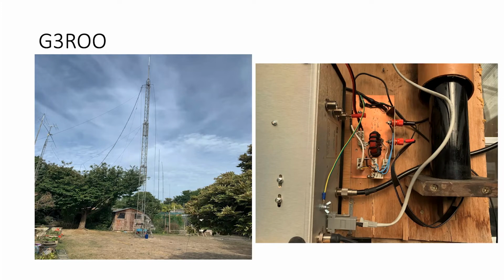There's not a vast difference. It's only 10 to 15 dB, 2 to 3 S points difference, but the difference is there, and it makes all the difference if you're trying to bust the pile up. I can't remember off the top of my head. There are 3 other bands, well, modes I cannot do, but I can always use it on either the Marconi or the doublet mode on all the HF amateur bands. So it's a complete aerial system. So much so, I've taken the beam off the top of the tower, I've taken the rotator out, and no longer do I have an HF beam. I'm more than happy with the performance of the aerial, but it's an unusual aerial. I'm very fortunate to be able to have that.